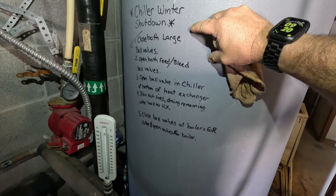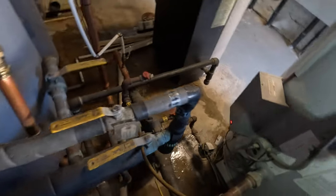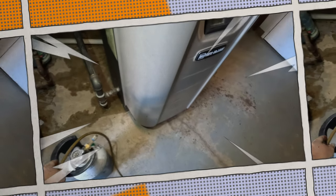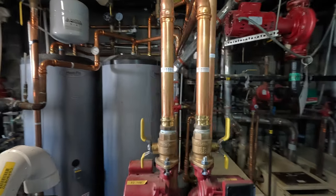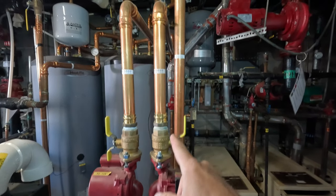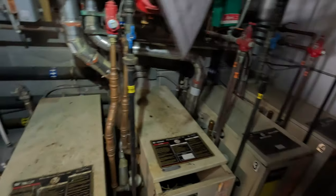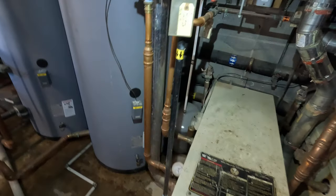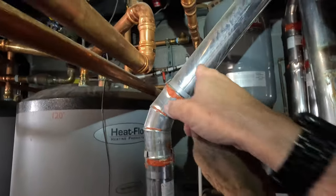I wrote this here for him to make it a little easier because they go through maintenance people quite often. This is the kind of thing that I do sometimes that's like, okay, how do you make that into a video? Not everything is glamorous. This was supposed to have gotten all updated - like I said, they were going to sell it. I believe we installed this boiler here, updated an expansion tank. We're going to turn on those boilers and make sure they work so he doesn't call back saying it doesn't work. This expansion tank is quite amazing - see how they have a ball valve in there going to the expansion tank? You should not have a ball valve on an expansion tank.